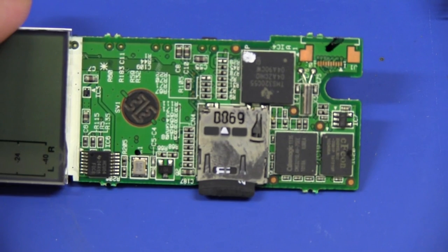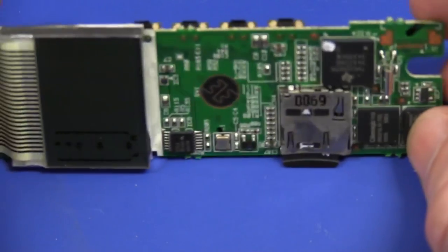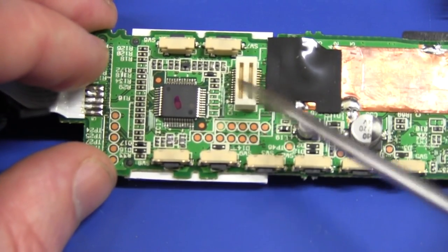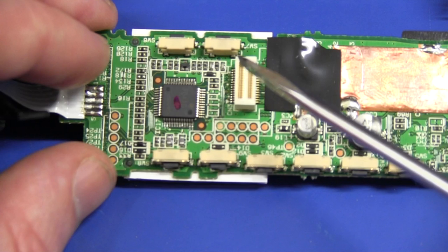The thing that's missing of course is the MP3 encoder capability. That's either built into the TMS320 - and I'm sure it's probably capable of doing that - but there's this mysterious device over here which we couldn't identify, which is close to the connector going through to the top audio board. One thing the TMS320 processor is not going to have is LCD driving capability, especially to drive all the segments on this display. So clearly, given the location of this micro, it's pretty obvious it's the LCD controller - it's close to the tab connections on the left-hand side. That's some sort of maybe custom or rebadged LCD controller. And that means the MP3 encoding must be done in the TMS320, hence the extra external SRAM and ROM required.